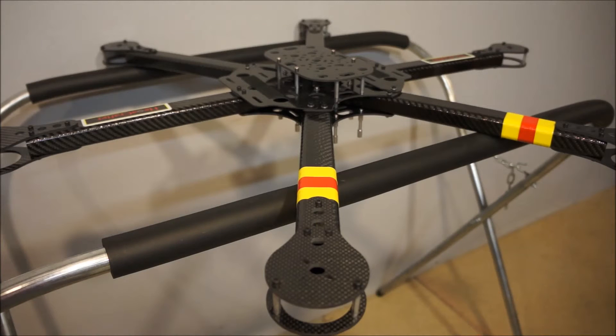We have looked at other frame assemblies and tried to play with this. Some perform a little better than others with shimming. Some frames simply aren't rigid enough to make any difference — when the motor is aligned at this moment, as soon as you bump it, it is immediately out by that degree. Some other frame assemblies using square or rectangular arms also have their challenges. Many of them use two bolt holes on the motor mount instead of triangulation, so you can actually see the motor mount twist on the bolts. We have had difficulty obtaining perfect motor alignment that stays aligned in those frame conditions.